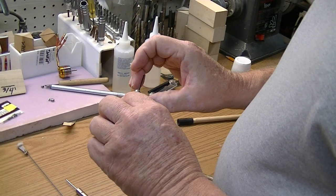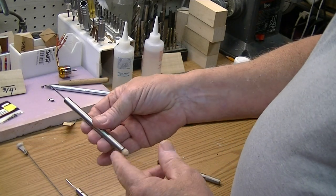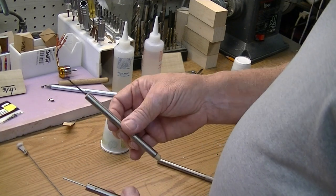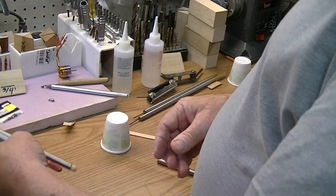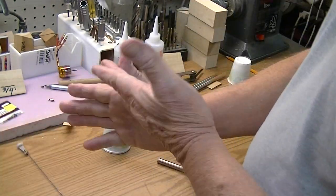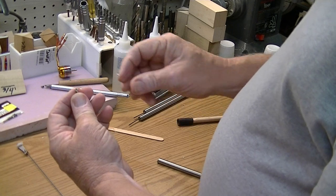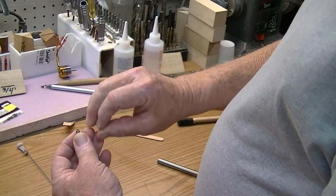Make sure that's as straight as you can get it in there. If it isn't quite perfectly straight, that's alright — you'd be surprised, it works out pretty good. That's basically one of the tools. Now I can color the tip a little bit to give me an idea of what size it is. This particular one's 1/16th. I was going to make a 1.5 millimeter but couldn't find an Allen wrench — my biggest problem is I misplace the Allen wrenches. We've all worked with these little stoppers — linkage stoppers take a 1.5mm.